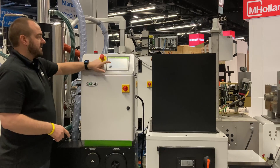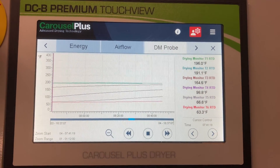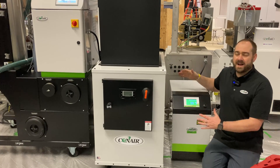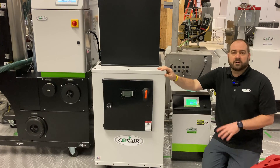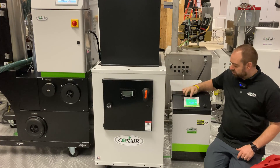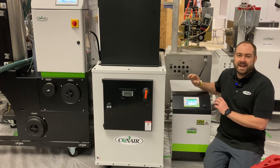You can see we're currently drying the material. Our set point in this particular instance is 200 degrees F. Also here behind the line we've got our chiller doing a lot of work in the background — it's providing cooled water to the extruder. We've got our brand new TWT Thermalator with a touch screen control, and what it's doing is providing heated water to the tank.